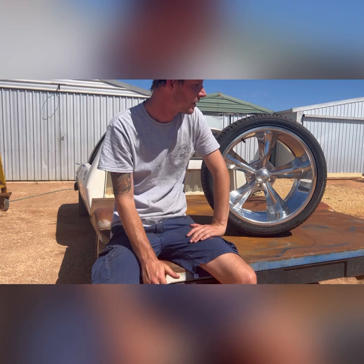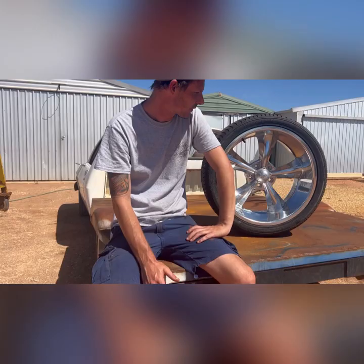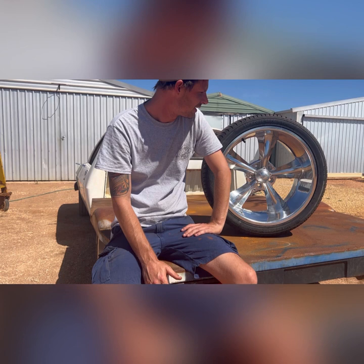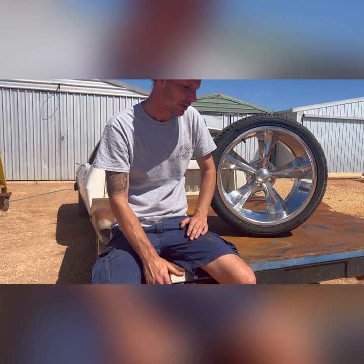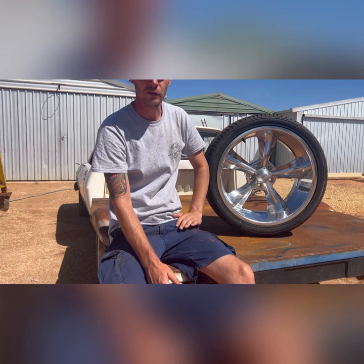I did some cross bracing in between and made them pretty tight because I'm only using 1.2 millimetre steel instead of 1.6. With the tight bracing I didn't really need the thicker gauge steel. You can do that part of the tray without your wheels or suspension set up — I actually did that on my workhorse which I'll be building in the future. But after that, if you want to go further and build what I call the sides — from here along — you will need your suspension set up and the wheels you want to be running. Get your wheels, get your suspension.